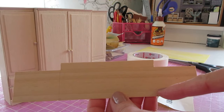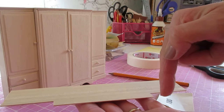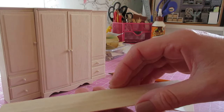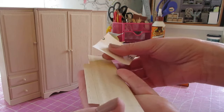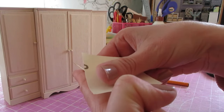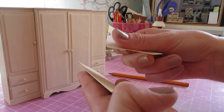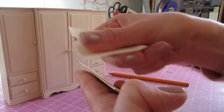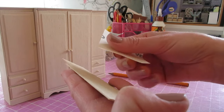The edge of the wood with your pencil lines on it is the bottom edge, so that will be placed against the top of the wardrobe. We now want to create a bevel along each of these cutouts and along each side. Because this is a fragile piece of wood, we're going to bevel it in our hand, supporting the piece as much as possible. I'm using 180 grade sandpaper this time to do fewer sweeps. Just sweep along at a 45-degree angle — we're not going to get a perfectly sharp bevel, we're just taking off that square edge to make it look more finished.